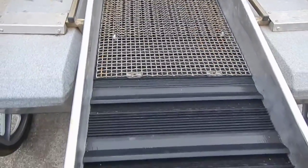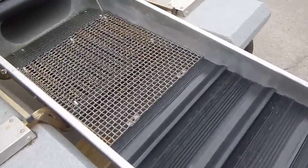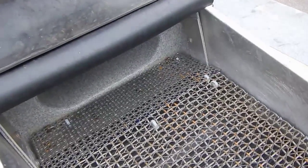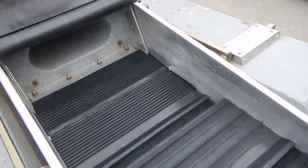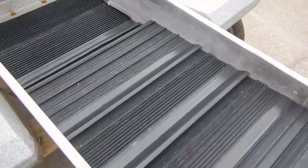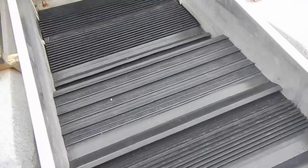What I'm hoping to get here is a little bit more fine recovery, and actually see if it works. My worry is that I've set the plate back a little too far, and I won't have enough water velocity to carry the water across the screens and onto the top layer to push rocks through. So that's going to be one of my trials, but I can't do anything about it until I'm out in the field doing a little bit of dredging.